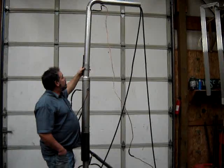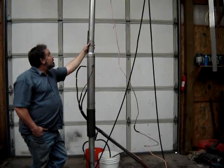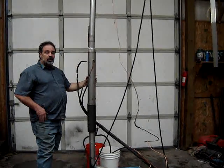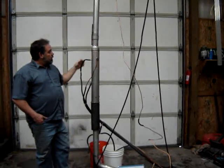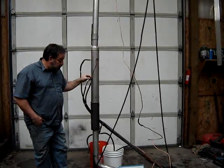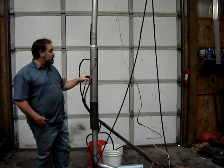This is the column that separates the alcohol from the water, filled with my secret packing, which I'm not going to tell you what it is. Down here is the rectifier section. In the rectifier section, we actually insert the beer. The new beer that comes into it has been preheated three different times, trying to reuse energy — so it's very efficient with energy.